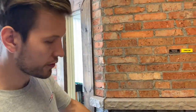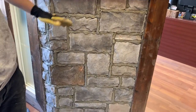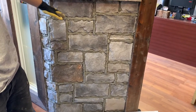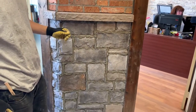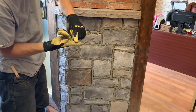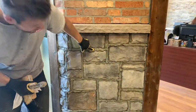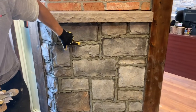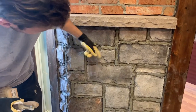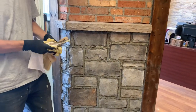So we've done all the joints with the grout bag. If grout goes over the stone, don't worry — don't clean it right away. You definitely want to wait for it to dry to about the consistency of wet sand. When you run your finger over it, you don't want to see anything left over. Now we've let the grout set a little bit — as you can see there's much more resistance. It's kind of falling off and it doesn't really smear on your fingers as much. That's the dryness that you want.